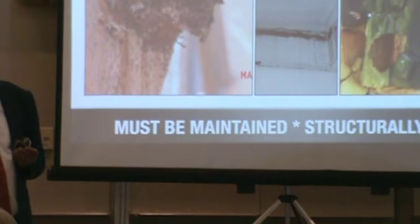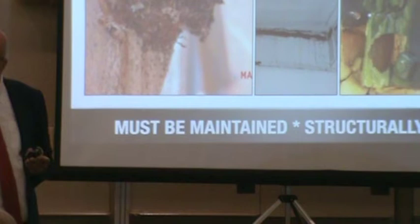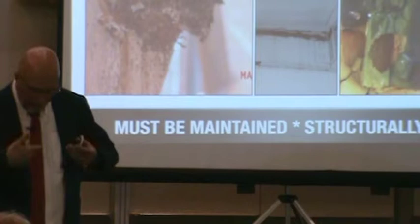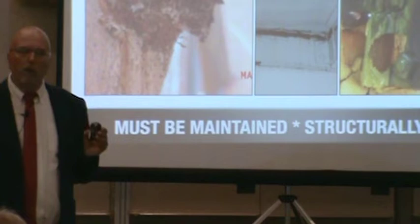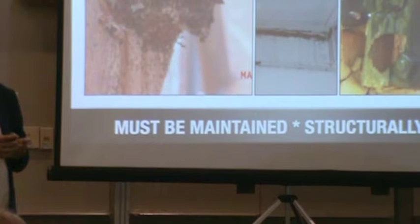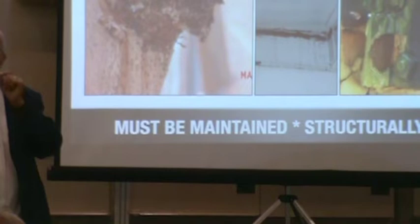That tread that killed that guy on the ground from an 8-story building: a woman inspector, an architect, was inspecting for the firm. She stepped on that tread and it gave way on one side, she fell through because it just pulled away from the other side. The same firm had said 5 years before that it just needed a paint job. So she almost got killed. That thing came down, ping, ping, ping, and you could kill somebody down below. So these are the kind of things we're now dealing with on structures in your area that are 75 to 125 years old, and only a few of them greater than that.